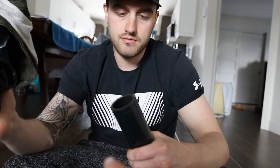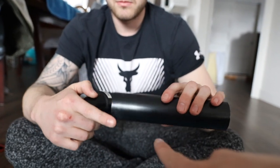We haven't put the cement in yet but it's already pretty stable without it — I'd still recommend the cement so nothing pops out. For the cement: add a coat about half an inch on each piece so it's liquidy, then when you push them together they fuse chemically. Make sure to put it on both the inside of the fitting and the outside of the pipe, then hold it in place for a couple of seconds because the chemical reaction creates pressure. It dries very, very fast.